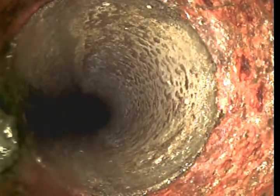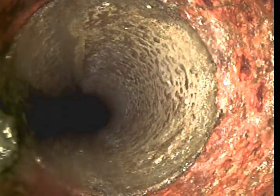Okay, so here's actually another transition at 100 feet, 4 inches. This is AC pipe, which is asbestos cement. This most likely is the lateral going out to the main sewer. It'll probably play further down, but we've reached the end of my camera. So there's no way for me to see further, unless I can get far enough to see something. This is roughly 120 feet. Oh, perfect. Thank you.